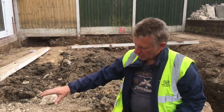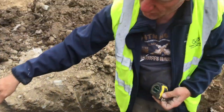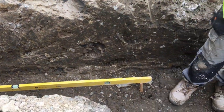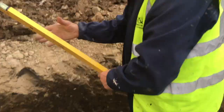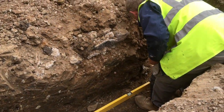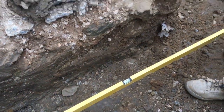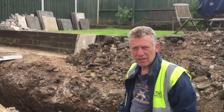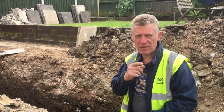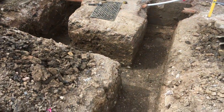Okay, what we're doing — we've exposed the nib, the existing foundation. All this has been passed now, so what we do is transfer the levels around to the concrete. We're measuring down and we can skim off wherever we want. A tip is when you have that, you turn your level around so it's accurate and level. We're going all the way around the trench down to the other side, taking pegs, knocking them in — that's how we get roughly levelled. If it's too high we can skim off. We'll catch you later when the concrete comes.